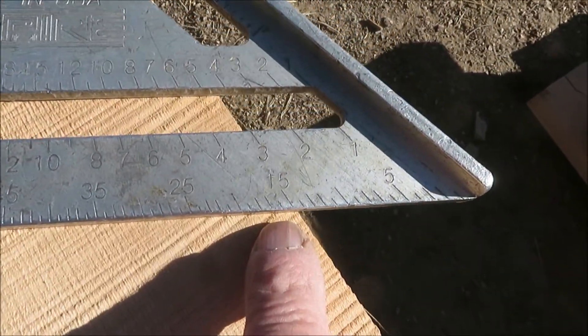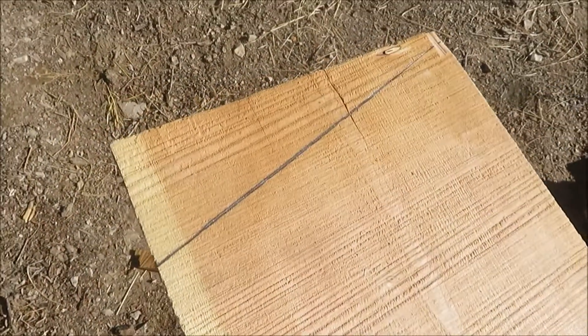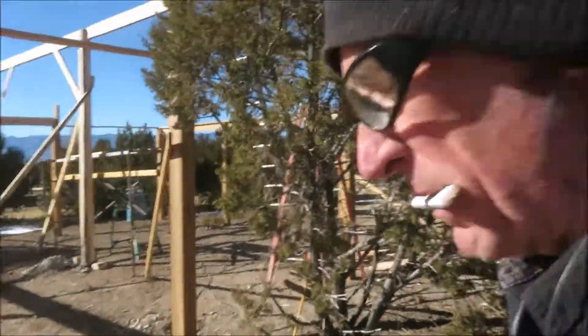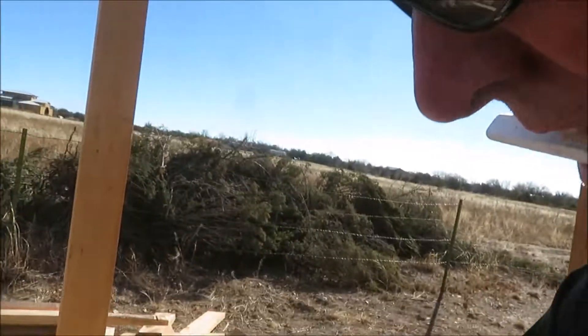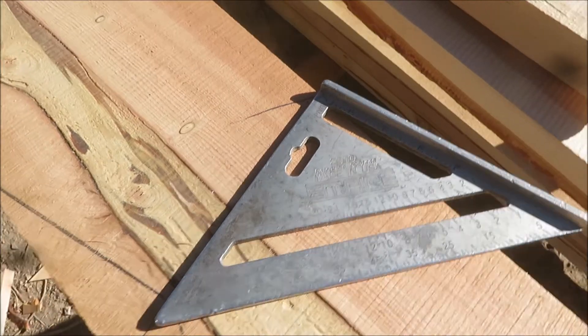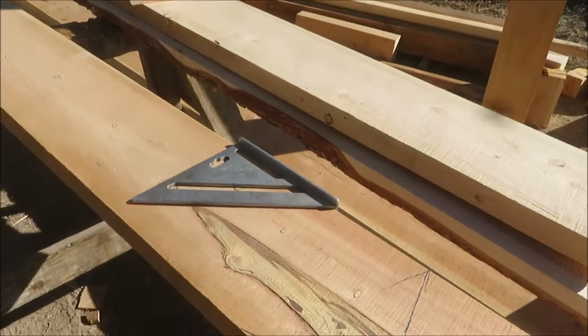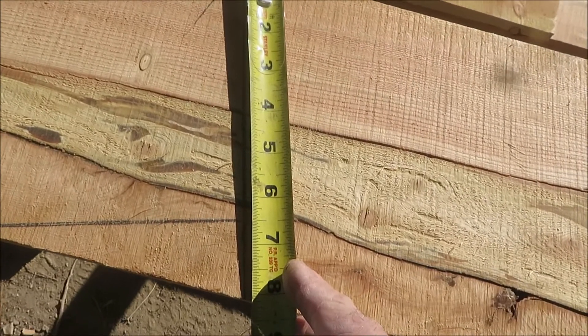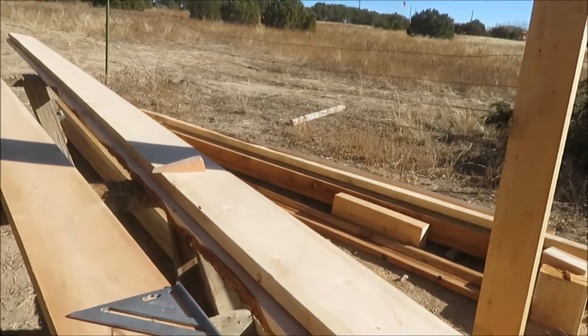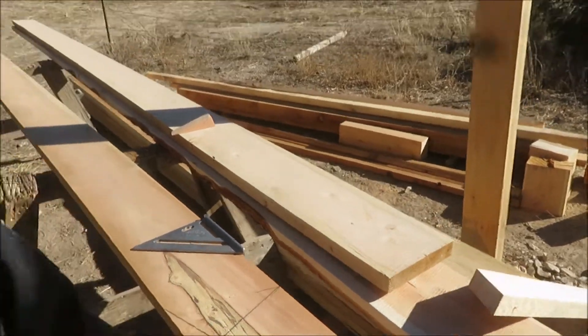Here's your 3 and 12 common — we'll pull our 15 foot 4 and mark it again. The seat is the amount of rafter that sits on the plate right there. So when I say a six and a half inch seat, it's the rise off the plate. We're constructing this barn without an eave, so there won't be any tail — if there was, we'd just extend it right here.